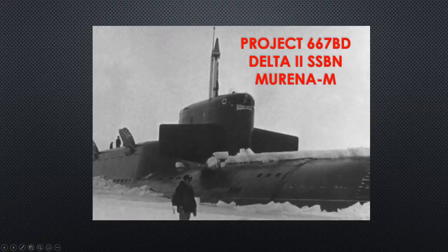Look at these fairwater planes — the control surfaces attached to the sail of the submarine. Different navies call these different things; the American Navy calls them fairwater planes. Notice how they're facing directly up or vertical. That's something the Delta can do to assist punching through ice when surfacing from dead stop below the ice. It helps cut through without damaging these control surfaces, since inside is a steel sleeve with a pinion that controls the angle. Too much ice weight could bend that pinion, costing control. The American 637 attack submarine had the same feature.